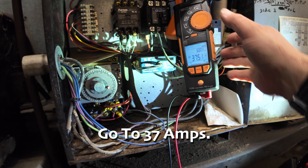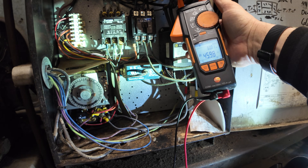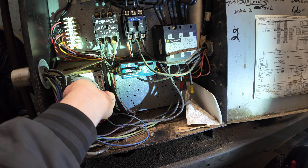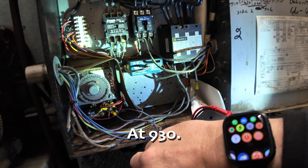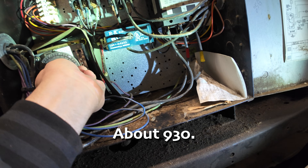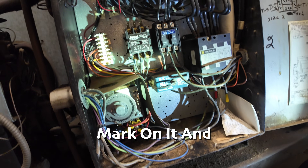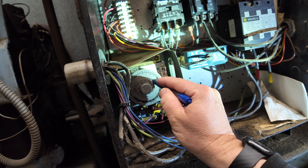What I wanted to find out was whether any of the defrost clock timer motors were defective or burned up when this happened, because some of them are 220–230 volt. So we're checking to make sure they're tracking time correctly. The cheap easy way is to just mark your dial on the inside and the outside and see if it turns.